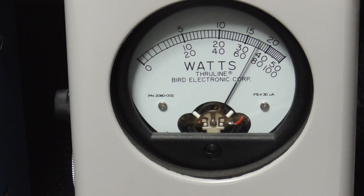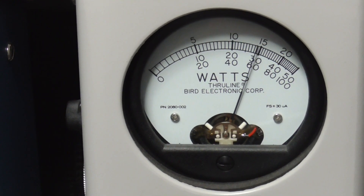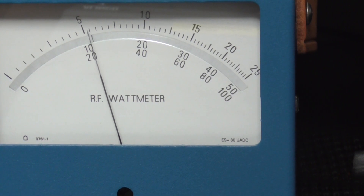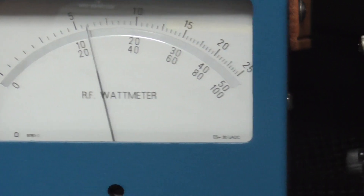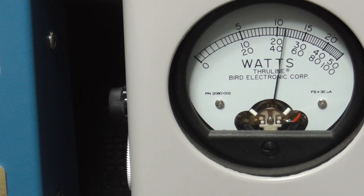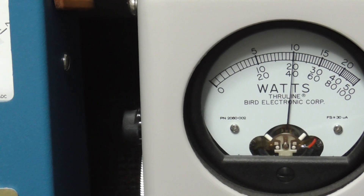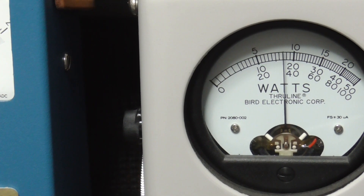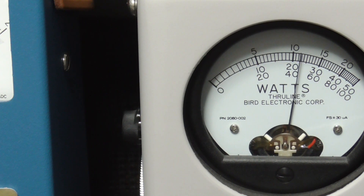When I was peaking around the 30-35 watt mark, I was dead-keying about five watts. One two three four, check check — so as long as your amplifier can handle about a five-watt dead key, it would probably work. I can see about lowering it a little more. At about two and a quarter watts dead key the radio does a little less, about 20-25 watts peak. You don't always have to run everything to the max. Running into an amp at a little less power is perfectly fine — unless you're quadrupling your power, the difference between 20, 30, 40, or 50 watts doesn't mean a whole lot.